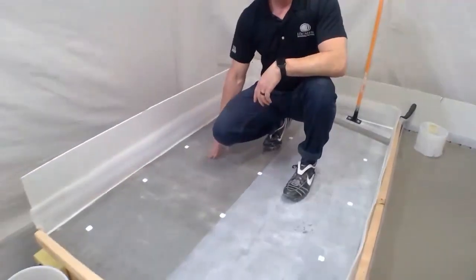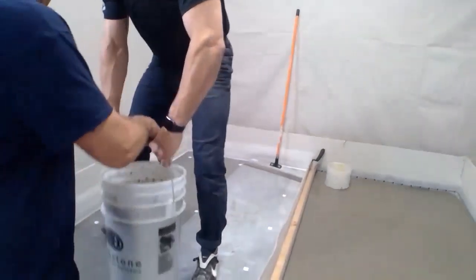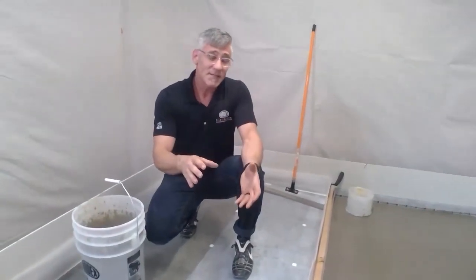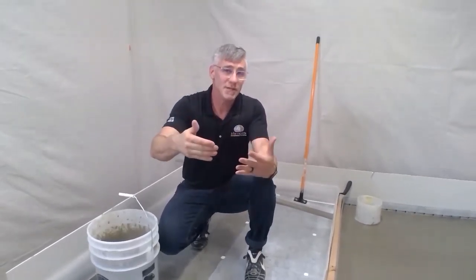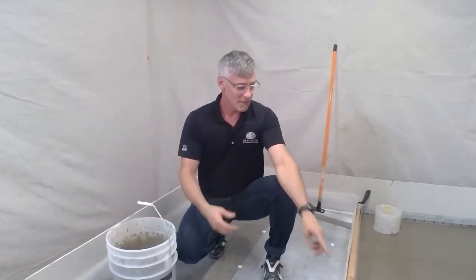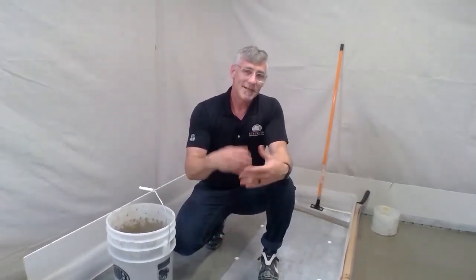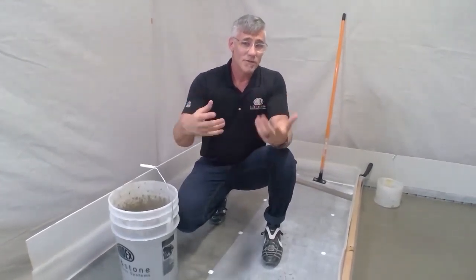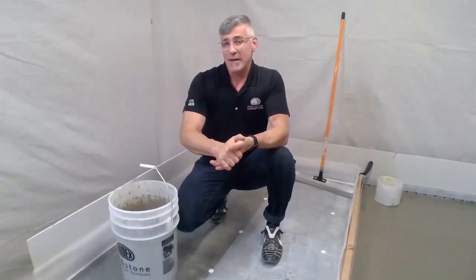Thank you, William. Will the spike roller work as well as opposed to the blade? The spike roller is an amazing tool. Now, it does have some disadvantages. If you're leveling over about a quarter of an inch, 5/16, up to 3/8, it starts actually pushing material. Also, if we're going over in-floor radiant heat, it doesn't really like to go over the wires very well. Or if we've properly pinned our floor like we have here, then it doesn't go over the pins very well. So I personally like a smoother. I do like the pin roller or spike roller if we're doing a cap. Say we're doing a quarter inch cap over the entire area, the spike roller is great.